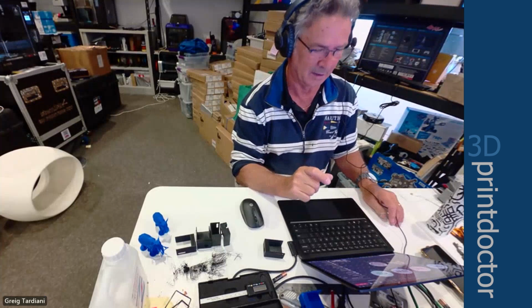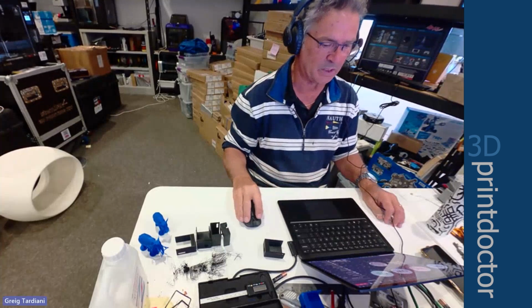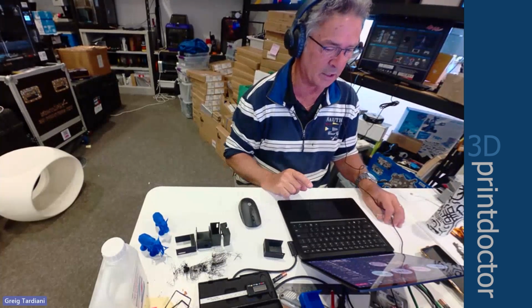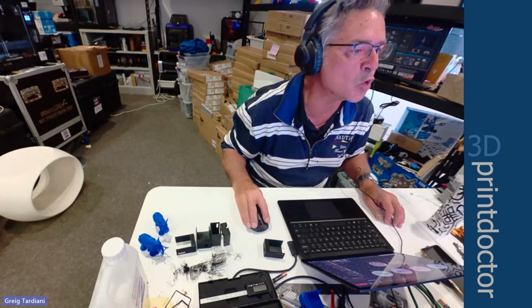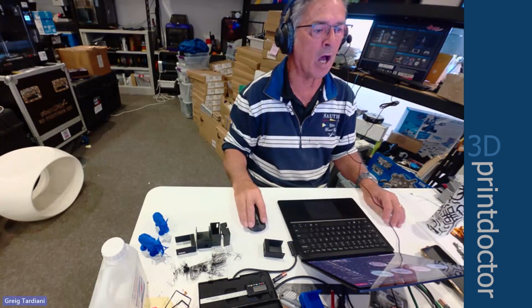No, okay, yeah, I saw that. Yeah, I thought that might have been a problem. Yep. So go and use a brim. And the brim is, when you do the start slicing, it's in the additions section. Right, okay, yep. And I go brim, and as a last resort, I go raft.